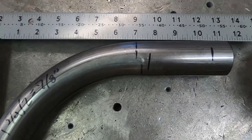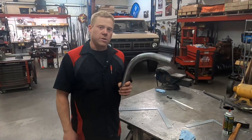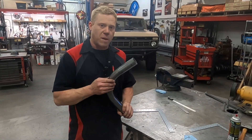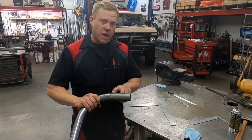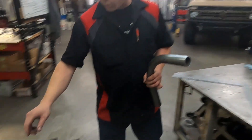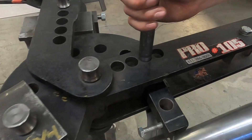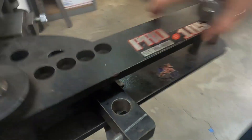This is why doing this is so important. That's how you take a simple 90-degree bend to figure out where your actual tangent or start of bend is and your bend offset. For this bender I like to use the edge of the strap. You could use the edge of the die, but the reason I didn't use it initially is because the edge of the die is hidden under here — so that's a very hard thing to see.